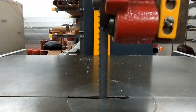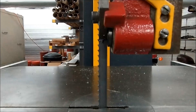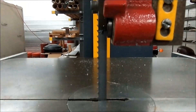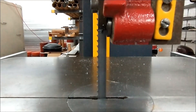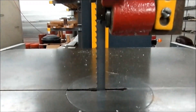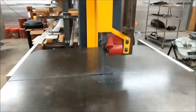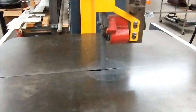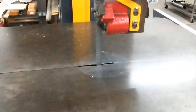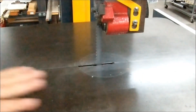Now this is a rookie mistake that a lot of people make when they're first starting out in this trade — they don't pay attention to the blade direction. This blade is now technically put on backwards. It's still facing forwards, but the teeth are now facing up. So against all convention, you would think this blade's not going to cut. Well, I bet it cuts through that aluminum like it's nothing, just by slapping the material out of the way. So: same speed, same blade, same thin material.